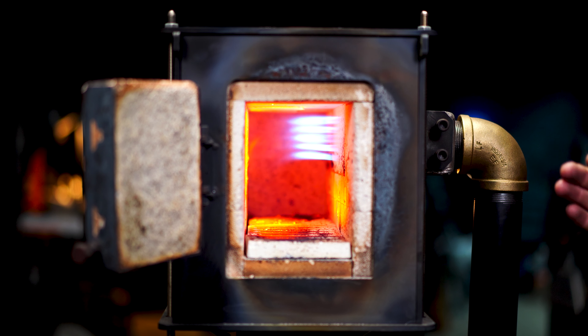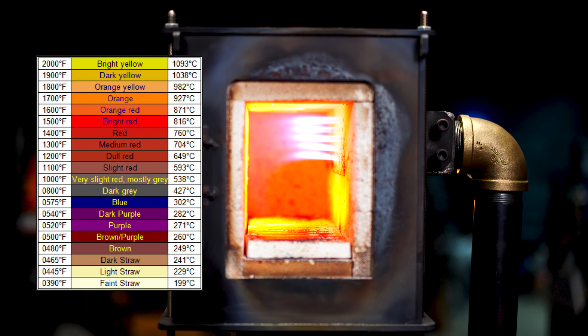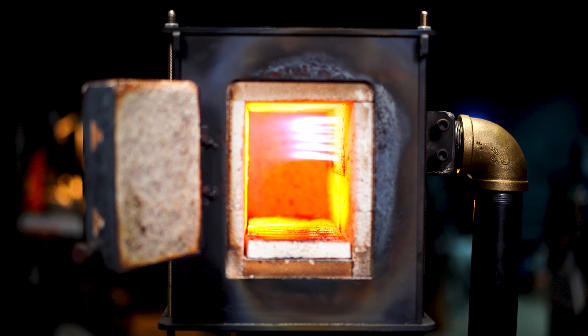A richer environment means combustion is happening all the way to the exterior of the forge, with about three inches of dragon's breath coming out from the face. When I close the door, it goes to about three to four inches underneath the door. If you have fire coming out above your door or around the 50% mark and higher, your forge is running too rich. I'm adding just a little more air — standing here with the door open, I can already tell it's about 2000°F, maybe just 5 to 7 minutes in.